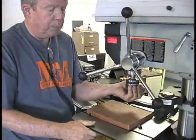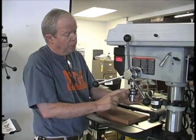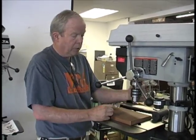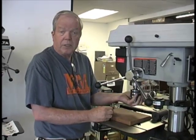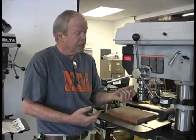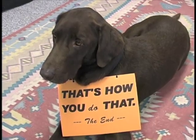That's all there is to it in terms of getting this up in there. This will stay in there as long as you keep it clean — make sure you clean it spotless when you're putting it in and don't let any dirt get in there. If it does start to fall out on you, all you have to do is clean it — make sure inside and outside it's clean. And that's all there is to replacing the chuck on a drill press.